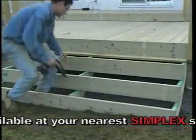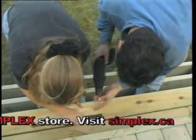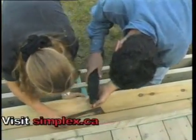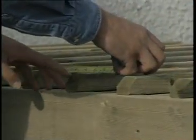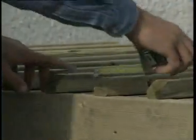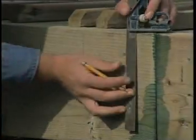Start by screwing in the risers, then, as for the floor, space and screw the stairs into position. Set the balusters on the patio every 4 inches. If needed, slightly readjust the distance between the balusters to avoid having a last, smaller gap.